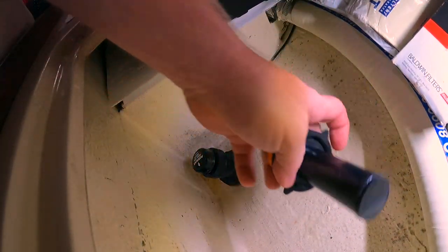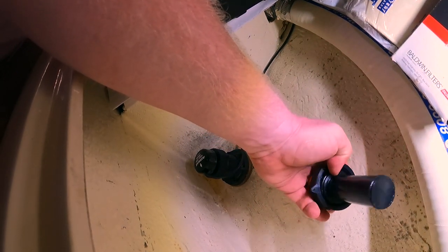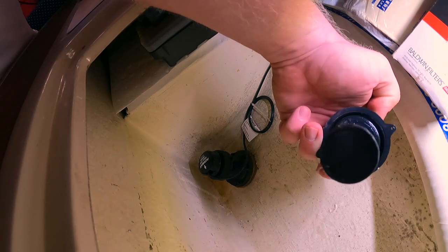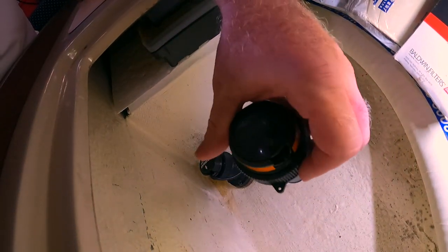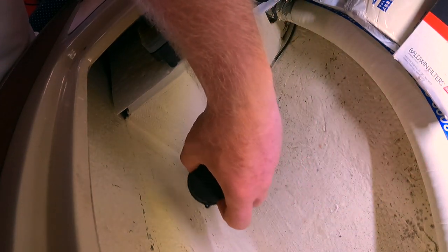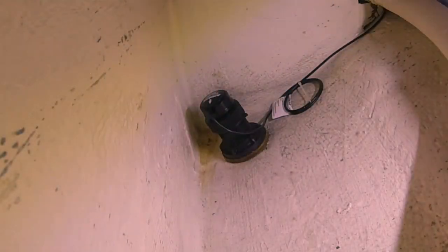You want to make sure you have a nice coating of silicone on the gasket and o-ring so when you put it in it doesn't bind up. If you notice, these all have an arrow pointing forward because this through-hull is keyed — the wheel has to be facing the right direction. The blank plug does the same thing with the arrow, so that's that piece.